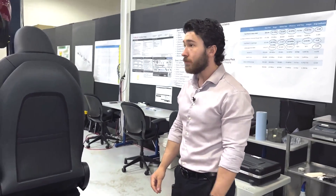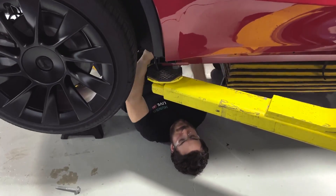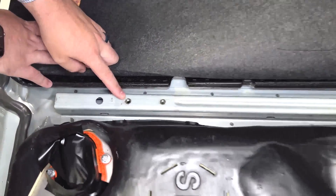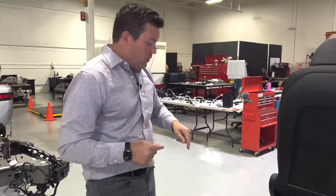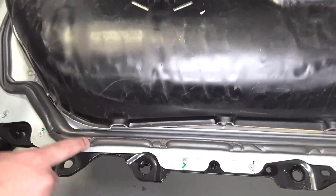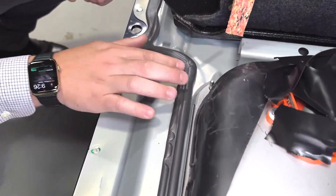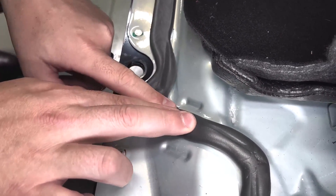So you said 38 bolts plus two, so about 40 fasteners secure the pack. It's 38 securing the pack, including four just above the penthouse here. You can see these interfaced with the rear gigacasting on the vehicle. These were the only real structural bolts on the interior of the vehicle. The rest were for securing things like the center console. Right here is where the rear gigacasting is. Notice that the shape — the witness mark from the pressure of that gigacasting pressing against the seal is really unique. One area where it could be a potential problem is right here where it transitions from this flat surface down. There's not as much of a witness mark, so we were wondering if this wasn't pushing as hard here.